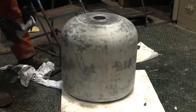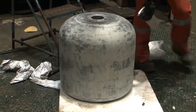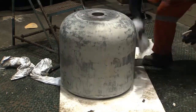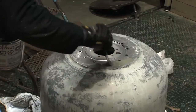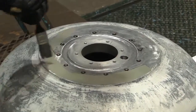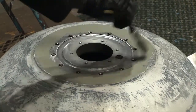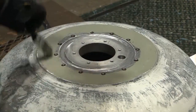Spray and wipe the sides of the tank in the same way. Begin repainting the tank, starting at the top, from beyond the outer diameter of the channel in which the gasket will be placed to the outer edge of the flat surface where the terminal will be placed. The paint to use is called Glyptol, which is a dielectric paint specifically for use on parts that make direct contact with or will go inside a transformer.